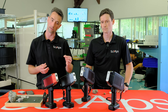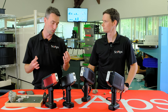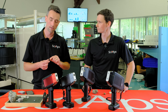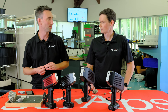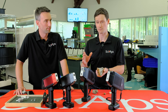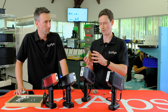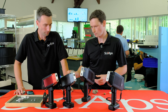If you want to get quantitative data, we're dealing with a very small spot size — we're testing 100 microns in diameter. That's the laser spot size. So you need to have a sample that is really a pressed pulp for LIBS analysis, for quantitative analysis. Why is it important to be pressed? That's a common question we get. If you're really looking for a whole rock analysis with LIBS and any technique, you have to homogenize the whole thing if you want a representative measurement. That's why these pressed pellets are so important.